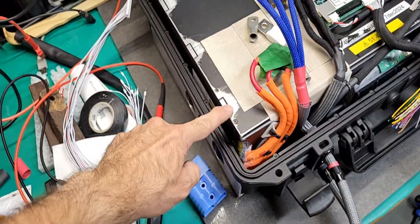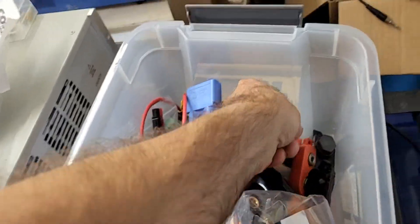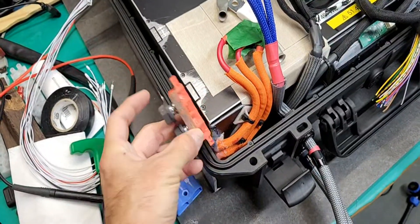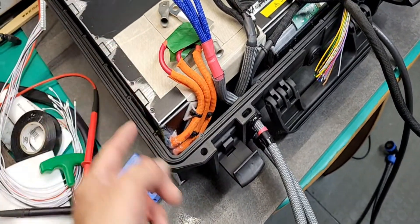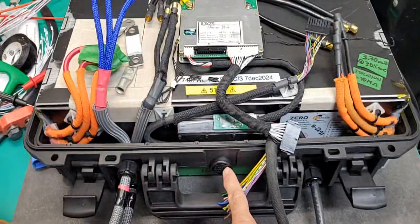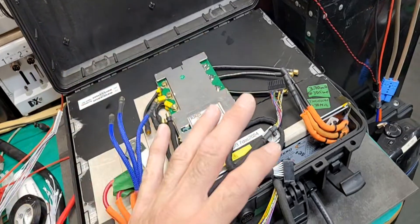Nothing has been done to perfectly match everything because nothing is made to fit precisely. There were mounts on this battery but to make it fit in the case I had to cut the extensions and the connector. I'll show you — these are the original connections that were installed with a screw connector, but I had to shave and cut the bus bar, solder eight-gauge wire to the bus bar, and seal everything because this case is pressure-equalized, meaning with temperature changes and altitude it will not breathe — air will not travel between inside and outside the pack.